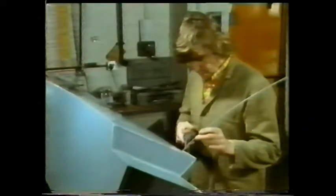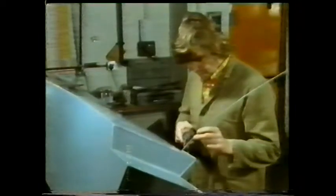Welding as a joining process is not only confined to metals. Here, we're welding a plastics material. Because this material melts at a much lower temperature, the heat source can be a jet of hot air. Do you think this is a fusion process?